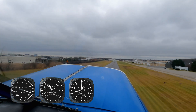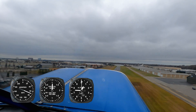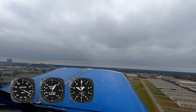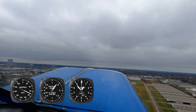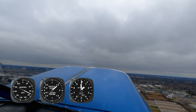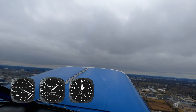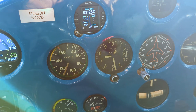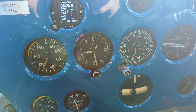So what's the verdict? The Lycoming upgrade has been pretty much what I expected: a slight increase in speed and range, nearly a 30% decrease in takeoff distance, and a rate of climb increase that's nearly 50% higher over 100 feet. I also didn't mention that I can hold 1000 feet per minute climb up to an altitude of 7,000 feet — you couldn't do that with the Franklin. The engine and prop work together perfectly, giving me the flexibility to optimize performance for any mission.